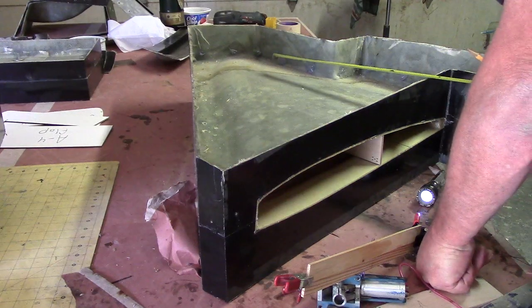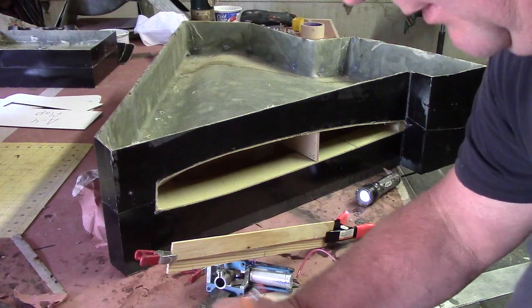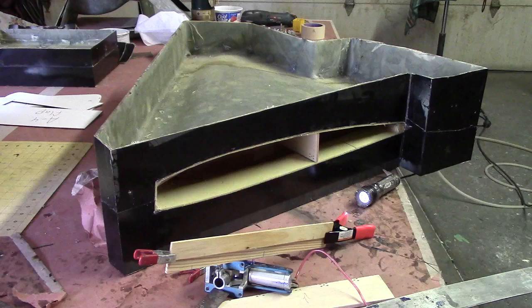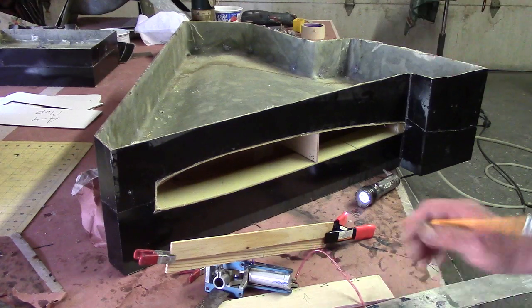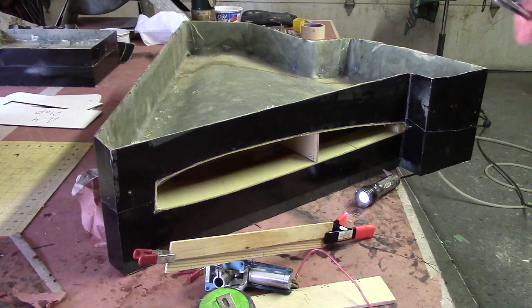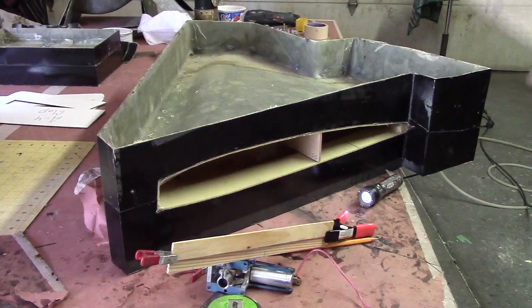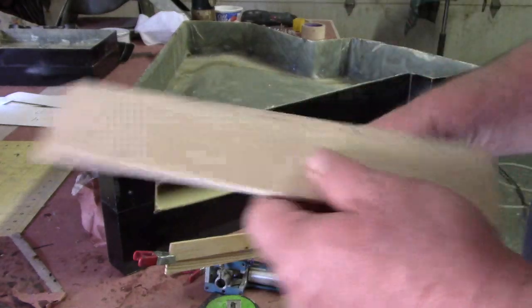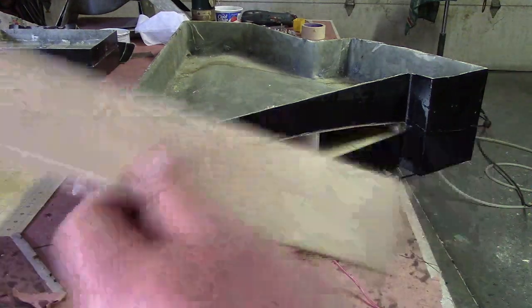Fifteen and a half — yeah, that's going to be good. That'll get us past that. An inch and five-eighths. I'm going to allow just a little extra so I can sand it smooth — just a little bit — and then sand it flat and it will be just perfect. I like all my patterns made out at a half inch instead of quarter for my router. Plus then I know it from my parts and won't accidentally use it. When I get all these done I'll just glue them to another board, cut them out, and then they'll be my patterns forever.